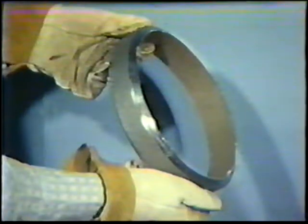To begin this exercise, each pipe ring should be prepared on both sides with a 37 and 1/2 degree bevel. Then grind a 1/32nd to 1/16th inch root face on each beveled edge. This root face should be consistent all around the joint in order to provide a uniform surface for the insert. A 1/16th inch filler rod can be used to gauge the dimension.